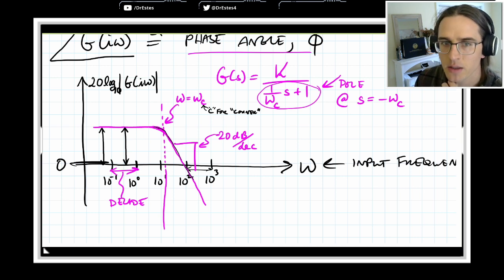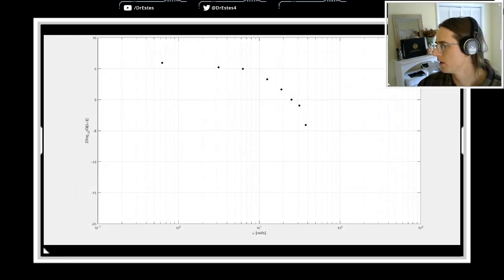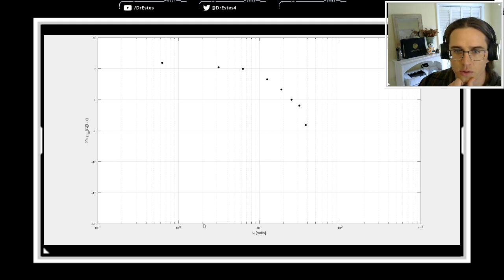Yeah, so this is a semi-log scale. It's a special scaling where, actually I have it over here. You see that the distances get compressed as you move towards the right. But the distance between 10 to the 0, 10 to the 1, we call that a decade. And so decades, we make those evenly spaced. Anything that's 10 times apart will be equally spaced. Like here, this is 10 to the 0, so this is 1. This line represents 2. So 20 is over here. So the distance between 20 and 2, that's a decade, because 2 times 10 is 20. So the distance between 2 and 20 is the same as the distance between 10 and 1. So you have to run it through a log before calculating with this unit.